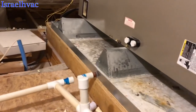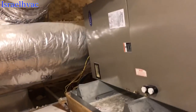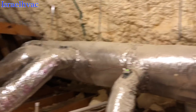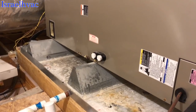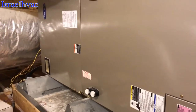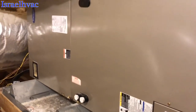They put a ball valve on this drain for some reason. It's a variable speed blower, so there's no capacitor to check, but I'll open it up and get a visual inspection of everything. We always look around, make sure the ductwork is intact and nothing's leaking. Everything looks good — the drain's not clogged, we cleared it out and made sure the evaporator wasn't dirty. Maintenance is kind of the same thing over and over, which is why I don't film it every day. The weather is warming up so we'll get some no-cool calls here before too long. Hope you enjoyed the video — thanks for watching, see y'all on the next one.